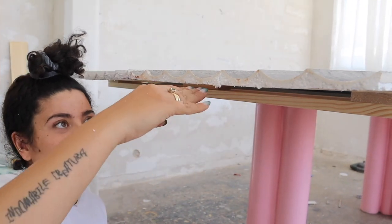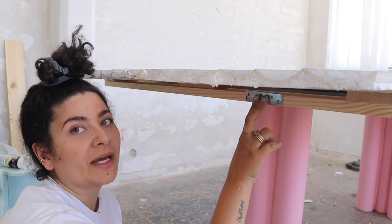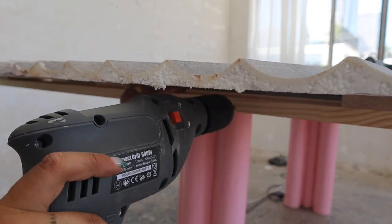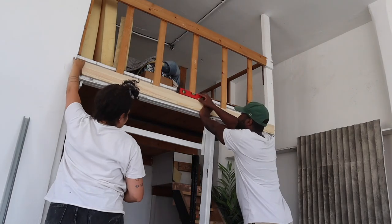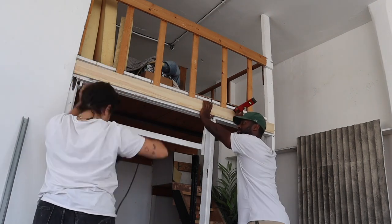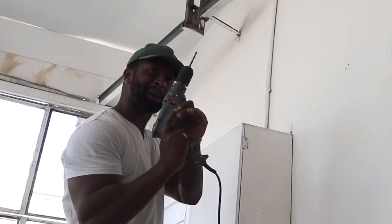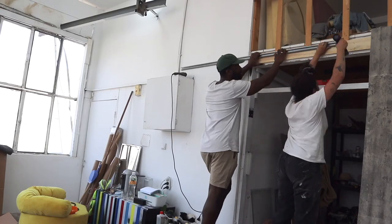Normally you just screw it to the top of the door, but we have this piece on the back just because we don't want to see the metal frame. So this is going to go here on the head of your door — if you have a normal sliding door it goes on the total top, but we do it here. Go and mark where you're going to make your holes, make holes on top, then put the screws inside and you're done. This is basically the hardest part of the full tutorial because we couldn't go straight. We have a leveler on the top that helped us, but it was so hard. You're going to see me now put a metallic frame on top of the wood piece that we stuck, because there was a level discrepancy between the wall and the door. You need a straight line to put this straight and be sure that the door is going to slide without any problem.